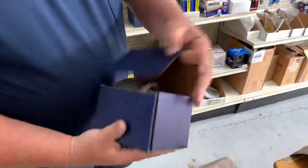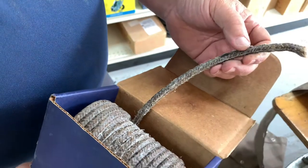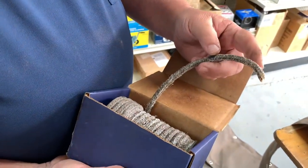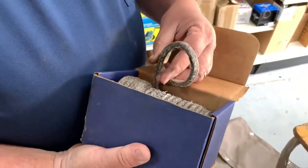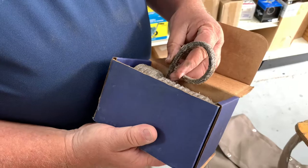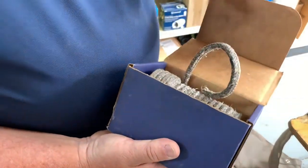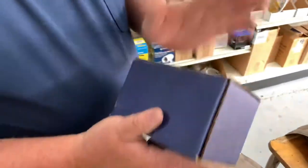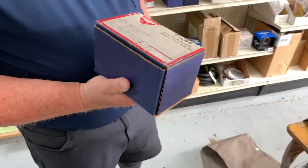Here's a quick look at the packing — I've got the quarter-inch packing here. That's what the packing actually looks like. If you don't have any adjustment left, you take it apart and put another wrap of this material around your shaft, put your packing nut back on, and tighten it down. It's actually that simple — crude technology, but it's what's been used for literally hundreds of years.